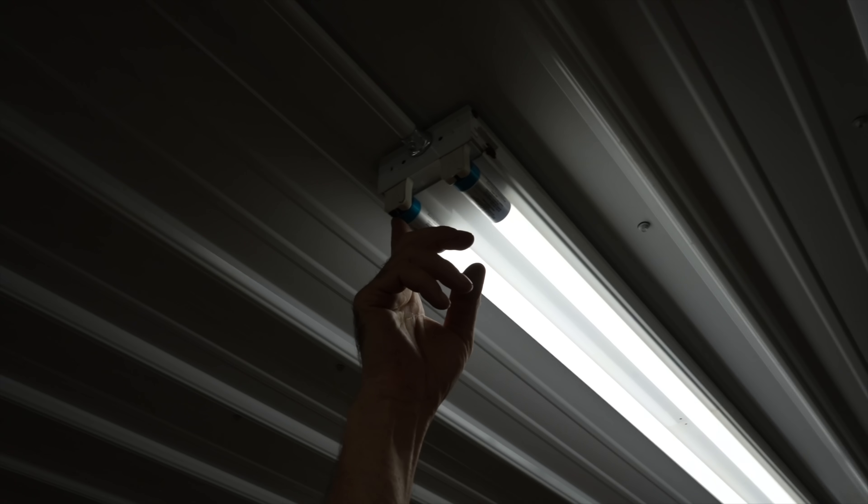There's going to be a little discussion about why I went this route. Because I know some of you are going, you could have bought those LEDs that link together. See, there's even one right here — a little four-footer that I put in, wired it in to the other ones. So I've got these, which look like traditional fluorescent lights. And I'm going to tell you the reason why I went this way and didn't buy those ones that you can link together. One of the reasons I didn't buy those is because I was afraid that if I bought a bunch of them and they burn out, you cannot replace the bulb. You have to buy the whole light again.